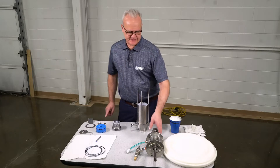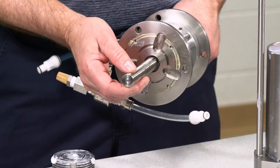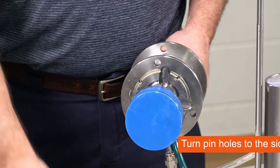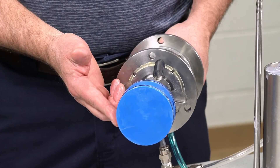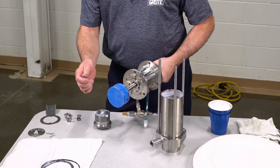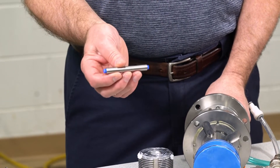So now we're going to put the piston onto the pump. You have a through hole here. The common mistake everybody makes is they put that hole straight up. You want it to the side so that when I slide this on I can take this pin, put it in there, rotate it to the side, and it's going to slide in. If I turn it the other way, it's going to fall out. This keeps you from damaging the two plastic tips that are on this pin. When you're installing this pin, if these plastic tips are missing, it needs to be replaced.